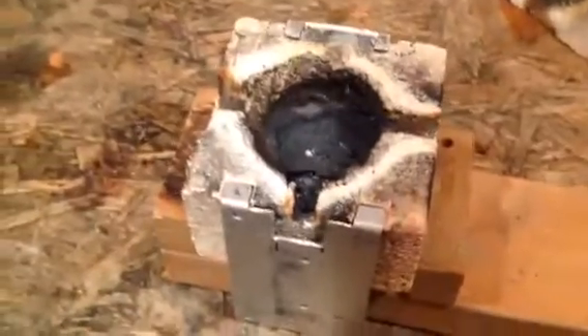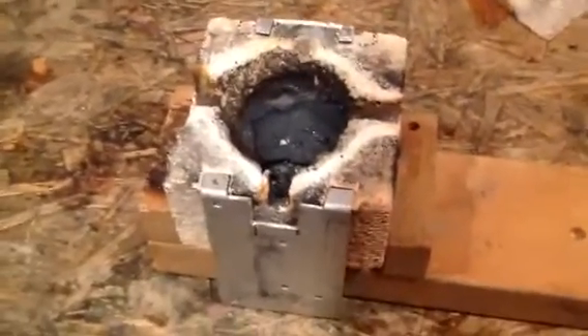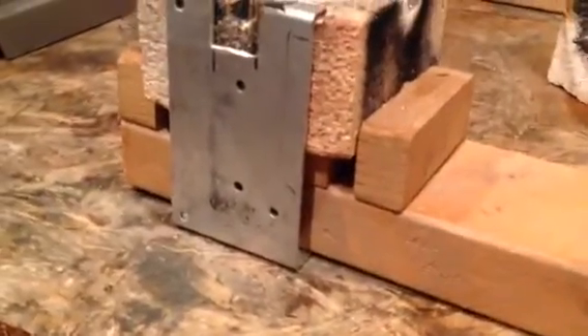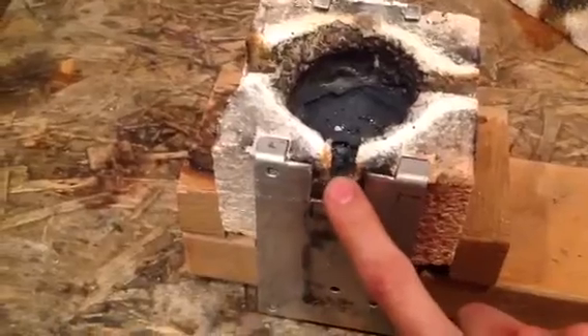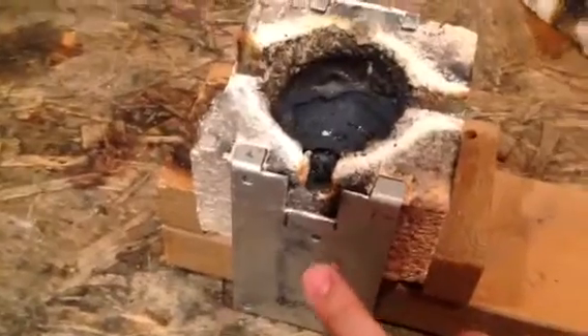To avoid burning myself again and to help successfully cast iron this time, I devised a kind of little handle. There is a large 2x4, and then wooden clamps that are glued on holding it in place. Underneath there are wooden standoffs that hold it up to be the right height for these aluminum brackets, which go into small pockets carved in the firebrick. There's also a hole cut in the aluminum for the pouring spout so that the molten metal goes over it instead of through it, because molten iron eats through anything.